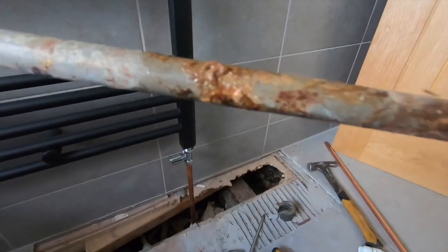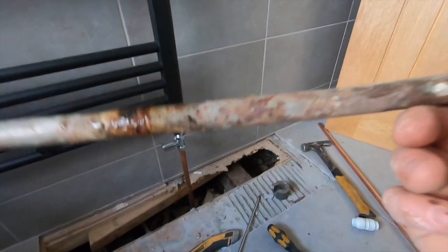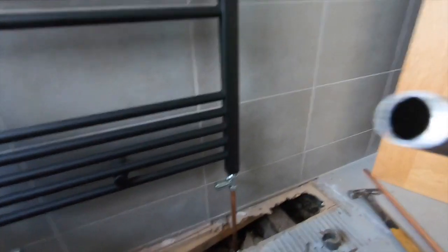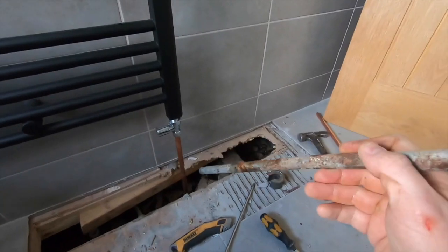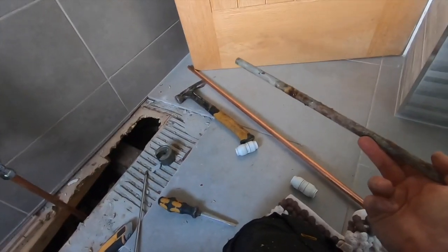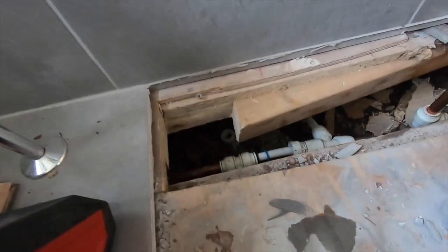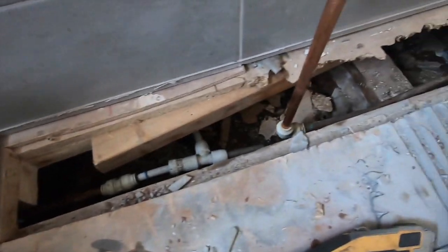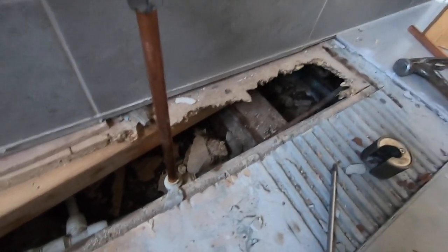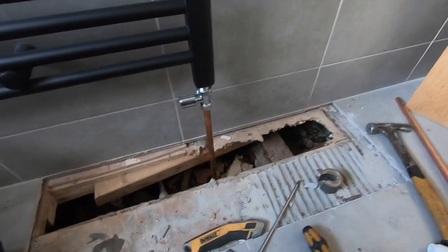That's the piece I've cut out — straight out of Jurassic Park. I think that's the pinhole there. Very, very old copper. So I'm just going to replace it with a piece of new copper, connect it with two Speedfit. Then all I can do is recommend they have it re-piped. This is a new bathroom apparently, and it doesn't look like they've done a good job. But I'll fix my leak, and that'll be that.